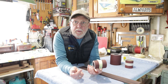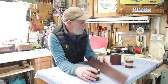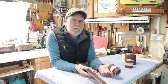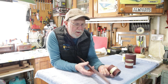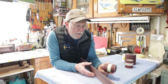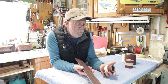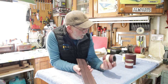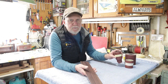So then they only work out a couple of pound each instead of £7 a shot, but they last for ages. Now this guitar we are building here, I normally get through at least 2 of these by the time I machine the top down, machine the mahogany and the neck and the fingerboard, because they always come in well oversized. But with this emery cloth, I only use one paper to do the whole job. It's all been sanded out to 120, so I do everything else by hand now. But it's great value, it's a fabulous machine. So treat yourself and get yourself a drum sander.